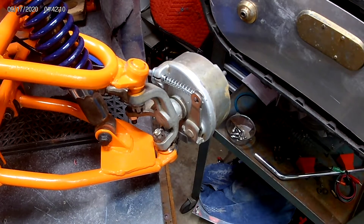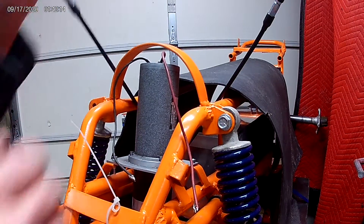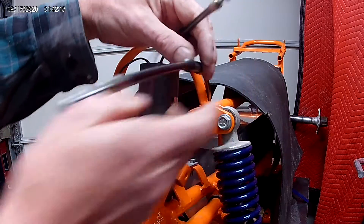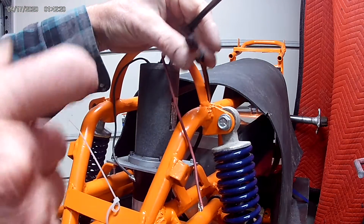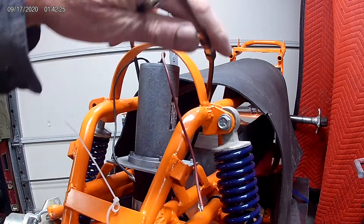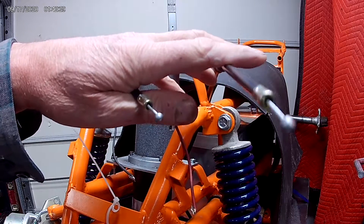And there's one for each side. So these two cables — I've replaced them both. I want them to be as good as possible. What happens to cables is they get corrosion inside, and they get very stiff and hard to pull. I got new cables just because it looks nicer, and now it won't take as much energy to put the brakes on.